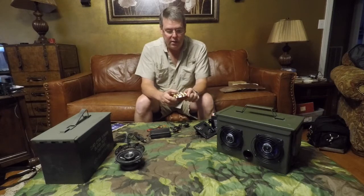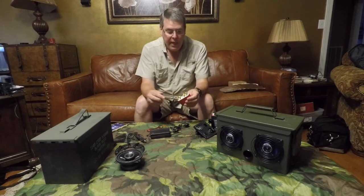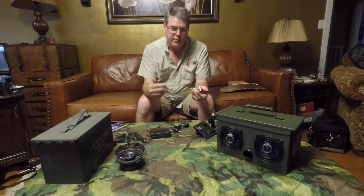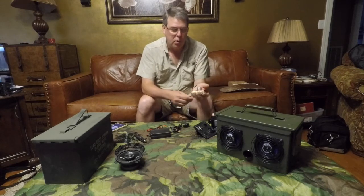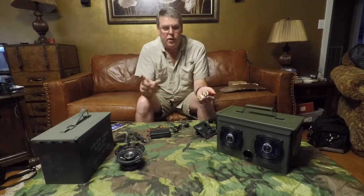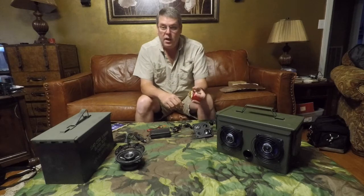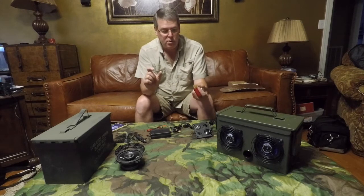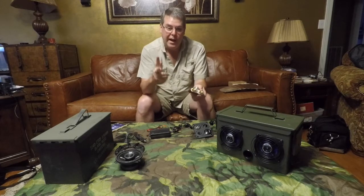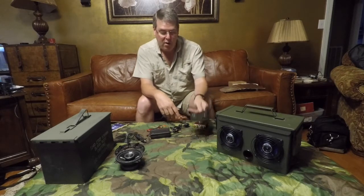Now, you've got your DC 24 volt in, but it will work off 12 volt. If you get one without the power supply, the one with it plugs into your 110 or home outlet, and takes it from 120 volts, 110 volts, down to 12 or 24 with a transformer. You don't need that because you're running it off the battery. But if you don't get that, you're going to have to make a plug to go in there and connect to your control panel, so when you turn it on. So you can either get the special plug that goes in there, and I don't know what size it is off the top of my head, or order it with the power supply and simply cut that cord off, throw the rest of the transformer away, and use that connected to your wiring harness inside here.